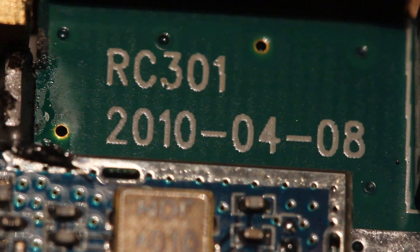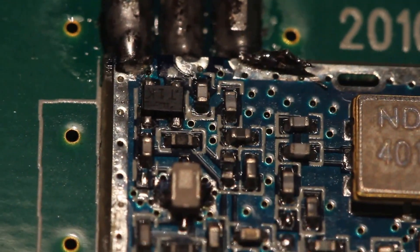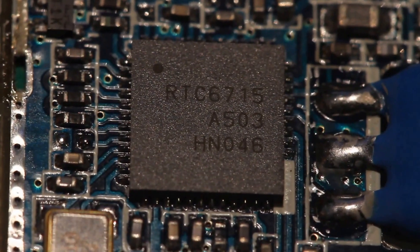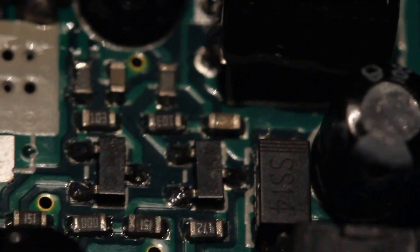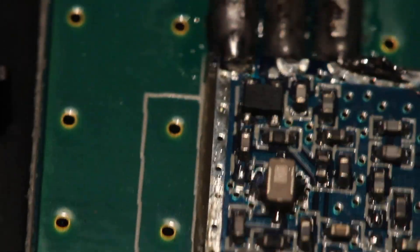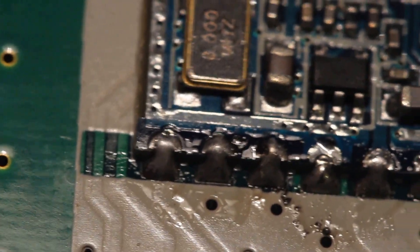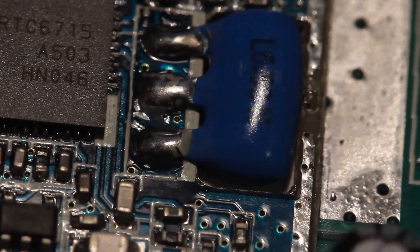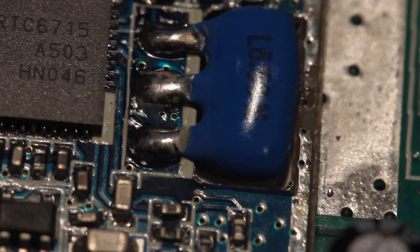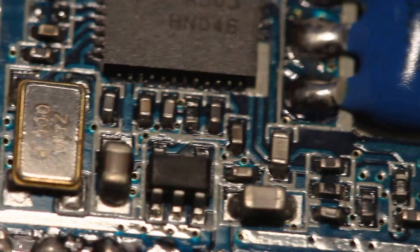So I thought I'd take a quick moment to look at it under this macro lens and see what makes it tick. Here's the antenna connector, the actual chipset, a 5-volt regulator, a bunch of connectors, and an LED. This is just a standard module that they solder onto a secondary board that breaks out all the connectors.